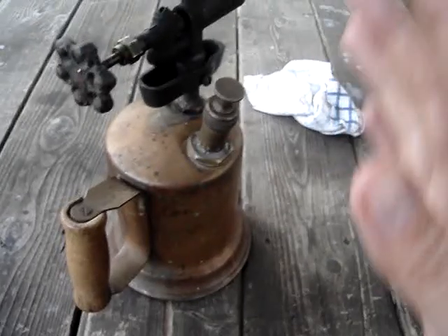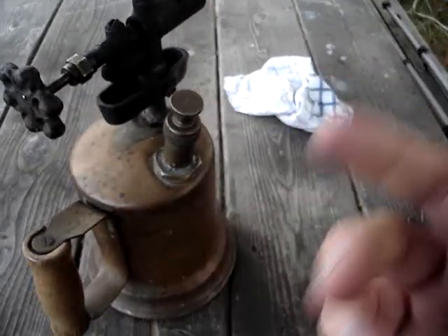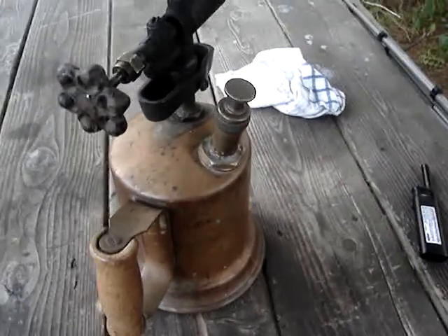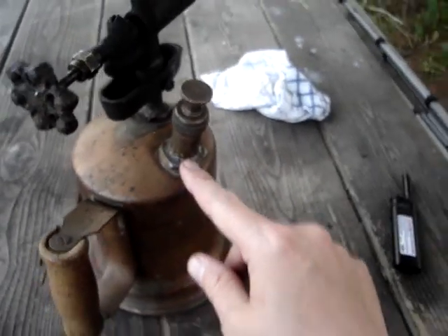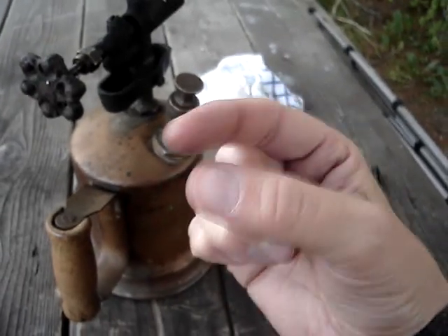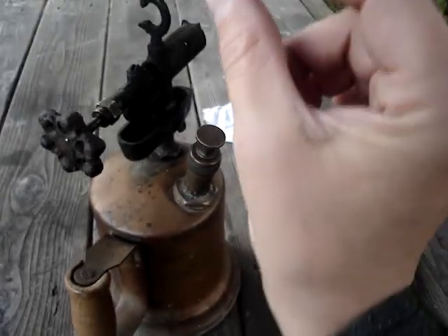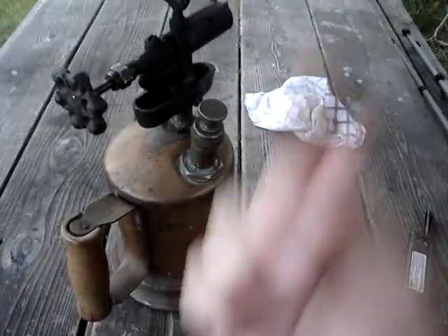It's got a spring and there's like a little T-shaped thing with a cup on the end, and there's a seal in the end of that — it's almost like leather, hard to tell what it is. On the bottom of the pump housing there's a little nipple that sticks out, and the seal kind of goes over that. When you pump it, it pushes it back to let the air go through, and then the spring shoves it back to seal it.